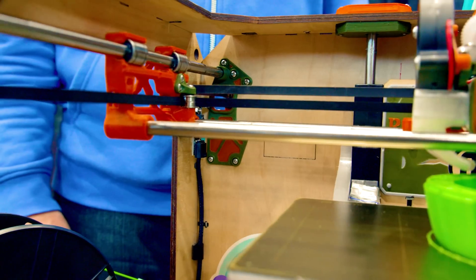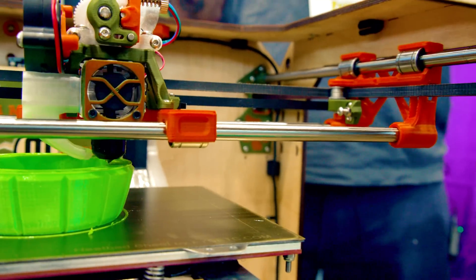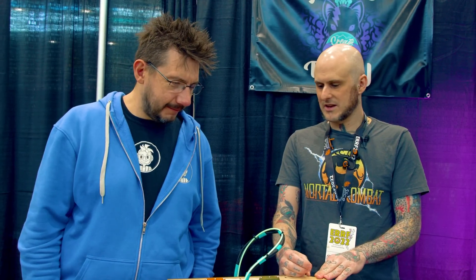It's a wooden box that tries to print like a Voron. Print quality isn't quite there — it's got the speed but the quality is not quite there. I'm getting resonance; I'm thinking maybe I need to put some dry-lube bushings in instead of the bearings. For all I know, it's going to go home and sit on the shelf until I decide to rebuild it into the next stage of its life.